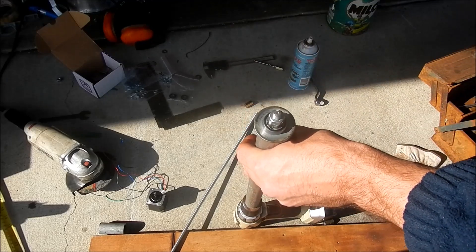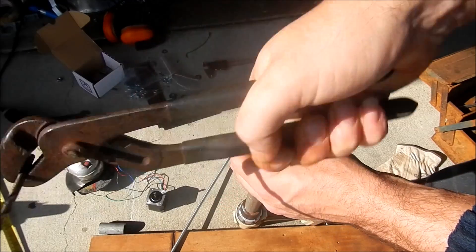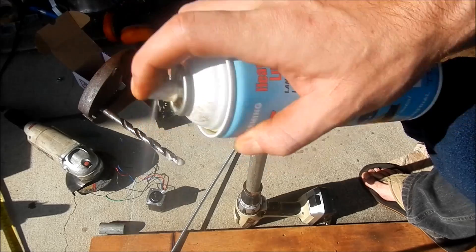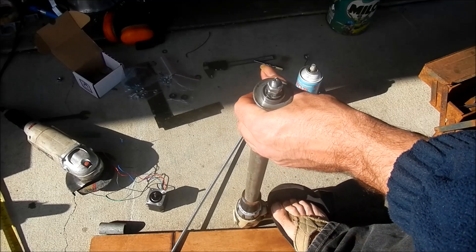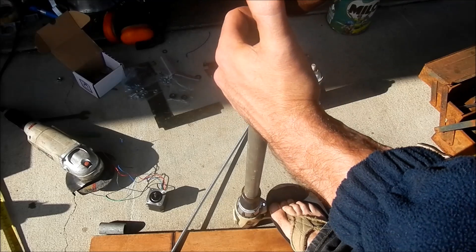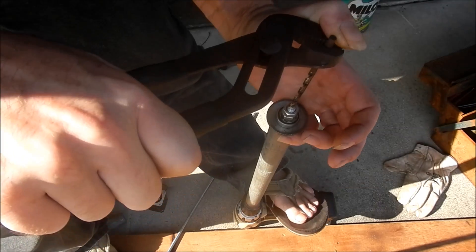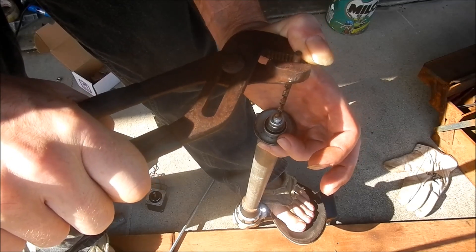So you can see there — I've got my drill bit and I just hold it in my big pliers like this, because I can squeeze really well with lots of leverage and my hand doesn't get sore. Spray my drill bit a bit of lube — helps keep everything cool and running smoothly. Put my foot on the trigger of the drill and I just squeeze down gently with my thumb — not too hard, but you need to apply some pressure. And you do want to keep an eye on keeping it straight and square as you can.